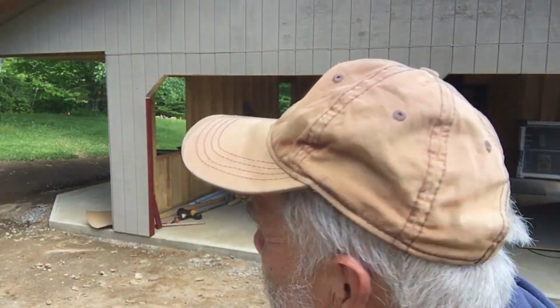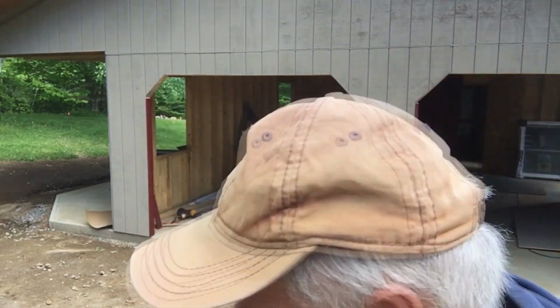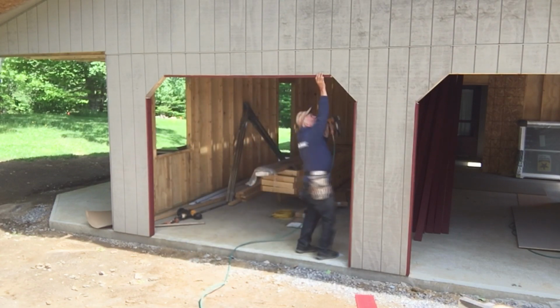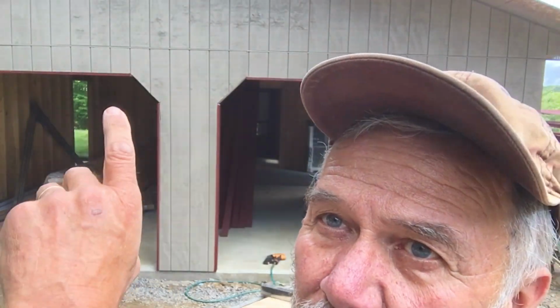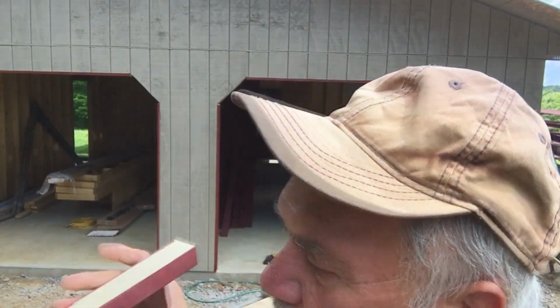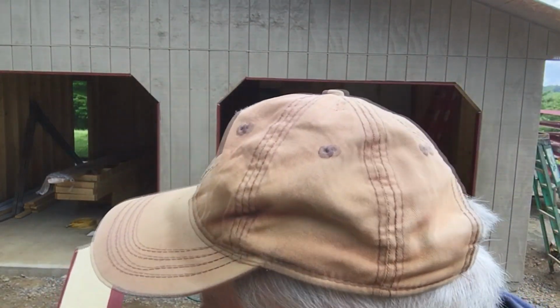So all the side jambs fit really well. We'll do the two top pieces, then it's easier to put in the angle pieces going on there. So I actually didn't trim that the way I wanted to. Typically I would run the top piece, run the bevel going the other way and the same coming up. Then you can adjust this coming up into there. I don't have that option. So now I have to cut it really precise. Sometimes it means cutting it more than once, because a 32nd of an inch will make a huge difference in whether or not that will go in.